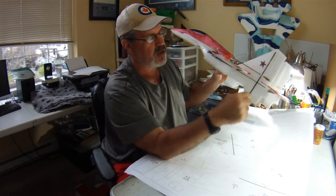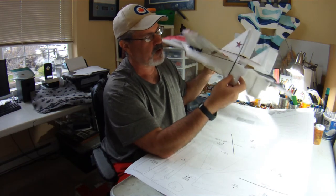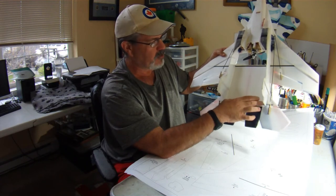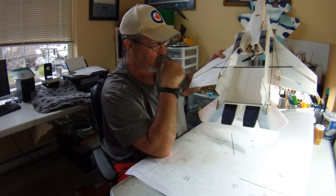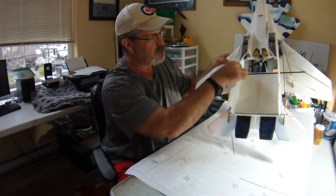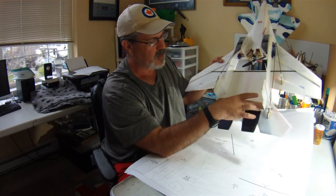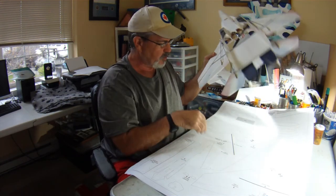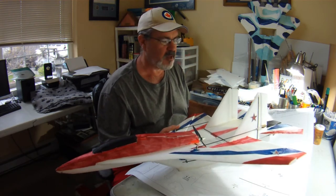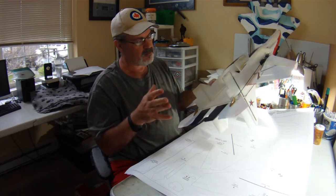It's going to be even a little bit smaller, so I shouldn't have to put any reinforcement in the vertical stabilizers like I did here — that's going to help shave a couple of grams off. Based on what I've been learning building with Dollar Tree foam, I have this piece of carbon fiber across the back plate, but I'm not going to put that in my next build because I don't really need it. The vertical stabilizers and the lower part of the nacelles really tend to lock in the back plate, so I shouldn't need to worry about torsional twist. By reducing the size of the elevons considerably, hopefully I'm not going to be putting a lot of torsion — twisting the back end too much in turns and rolls. That's a couple of ways we're going to save some weight.